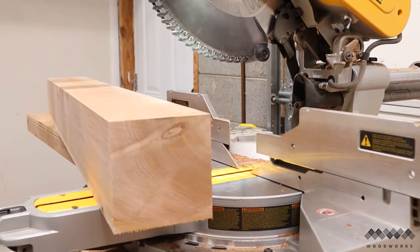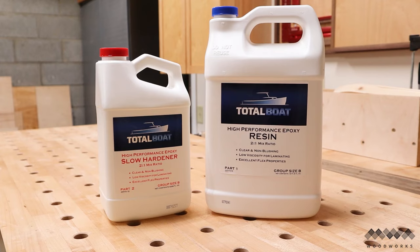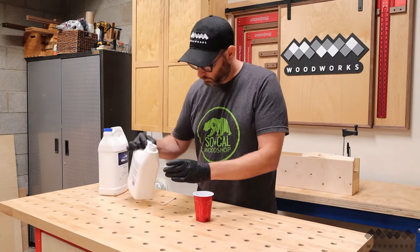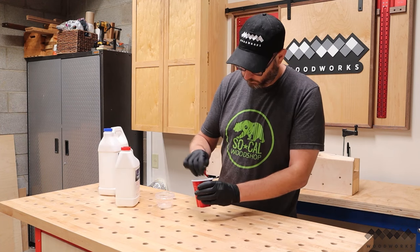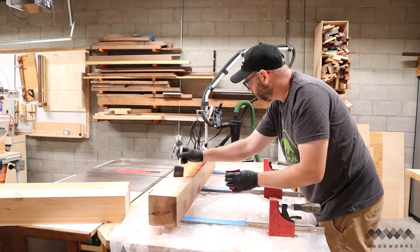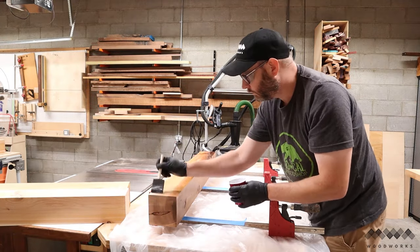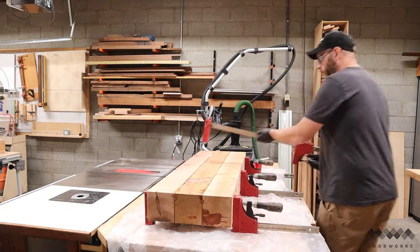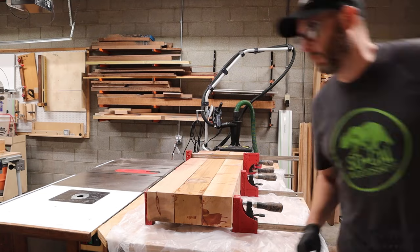To assemble the bench, I'm going to use epoxy. Since these are going outdoors, epoxy is a great choice for an adhesive because it's very water-resistant and strong. I'd like to thank Total Boat for helping me with this project and being the sponsor of this video. To use this epoxy, I just need to combine the resin with the hardener in a 2-to-1 ratio and mix it thoroughly. Once combined, I apply an even coat to the glue joints. The seat of the bench is going to be made from three of these beams, so I have just two glue joints, which cuts down on assembly time and also the amount of resin needed.